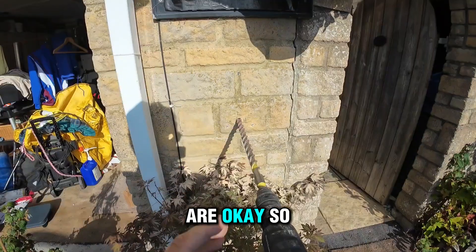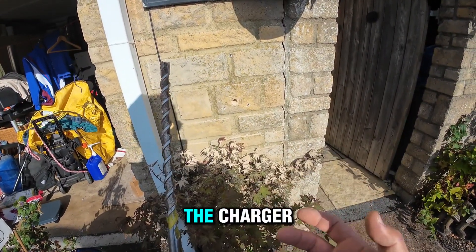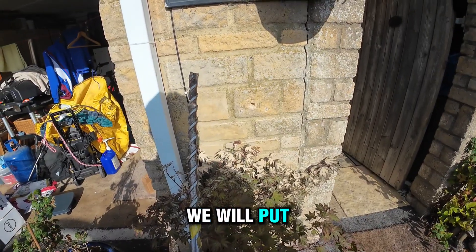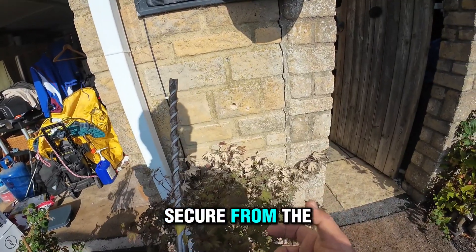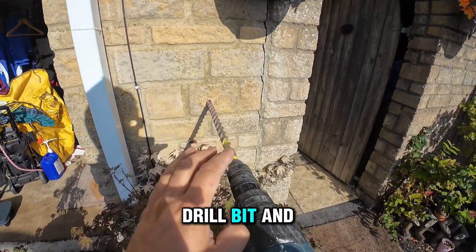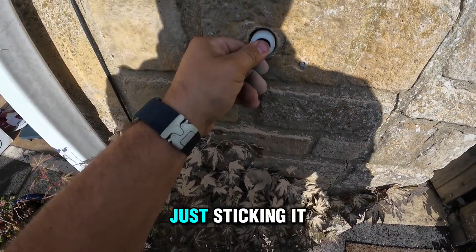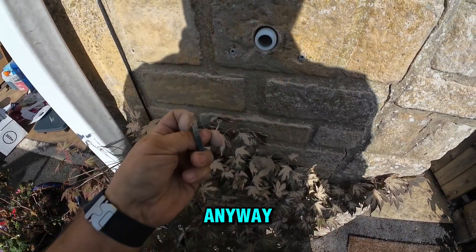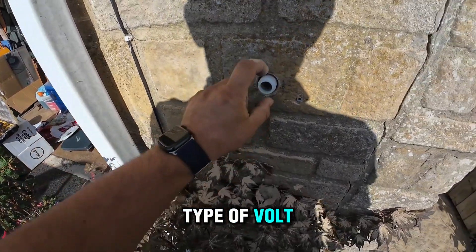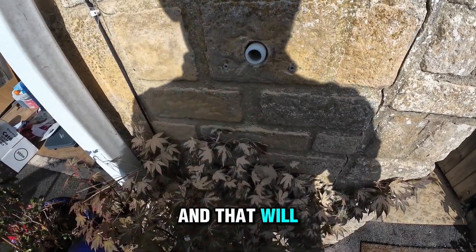So what we also have to do — this is 25mm — we need to secure the actual cable coming into the charger with waterproofing and IP rating. We'll put in a gland; I'm considering a reverse gland so it's secured from the inside. I'll go with the 25mm drill bit and create a little recess inside. We'll have a piece of conduit just sticking out, put adhesive around it to make sure it's nicely waterproofed, and once the HyperVolt is mounted, I'll drill the hole exactly where the conduit is and secure it with the nut — that will conclude the waterproofing.